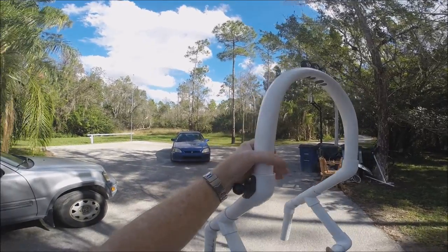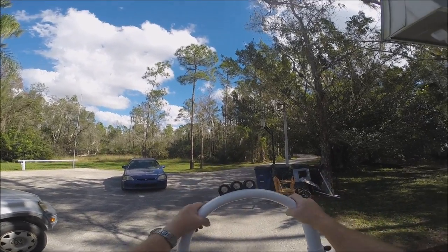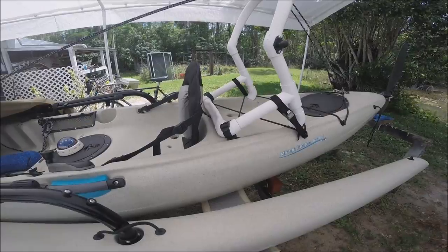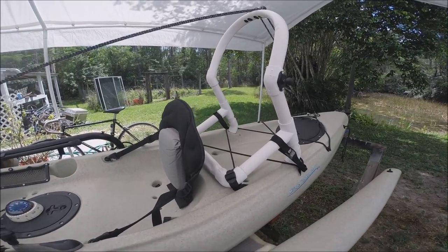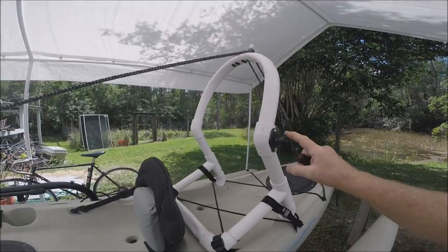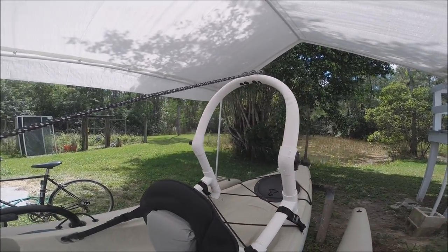Here's the latest iteration, the latest version of my main sheet riser slash utility bar. Got the main sheet guides here. I got a couple of RAM mounts here and here. I curved it, even bent it for a back relief. Here's my mount — the utility bar slash main sheet riser — raised the main sheet up off of my head. My head is usually here, and it also gives me a place to mount a couple of RAM mounts for accessories like a GoPro camera and a SPOT and or a VHF radio.